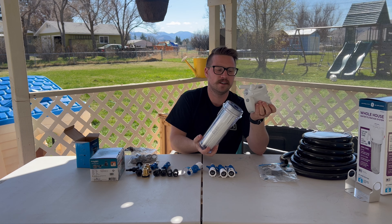If you want to make one of these boxes, I'll have it linked in the description — I have a video on how I built it. We're going to start with the pipe coming out of the tub. The first thing we hook up is the strainer, so we'll measure how much pipe we need — about seven inches of pipe. There are lots of different ways to cut this; I'm just using a cleaver. Once you have the hose on as far as it'll go, tighten down the hose clamp and put it back through. Then go ahead and put the strainer on.